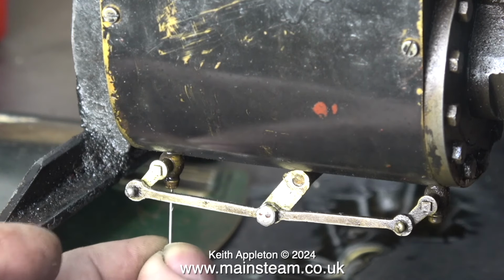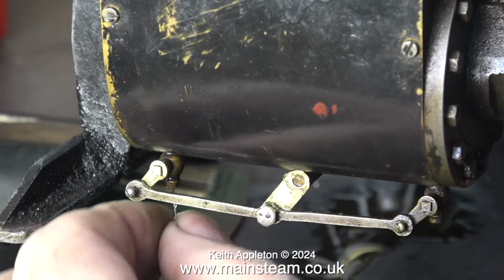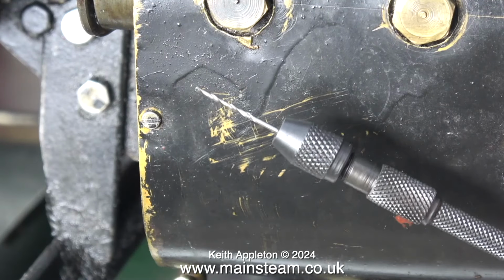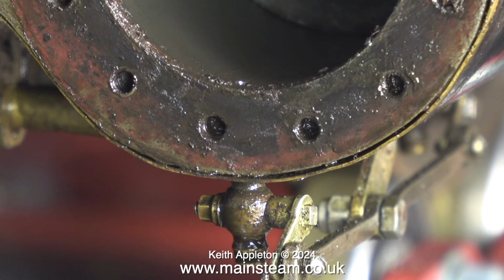At this point I should really say thanks for watching and I hope you found it useful, and leave the episode with a cliffhanger. But no, instead I will tell you what my theory is as to why the cylinder and piston valve rusted up. The reason is that the water could not get out of the cylinder after the last run.